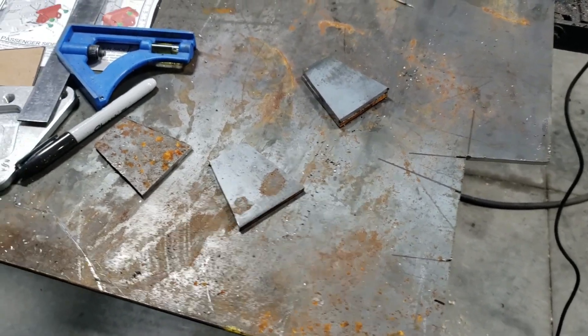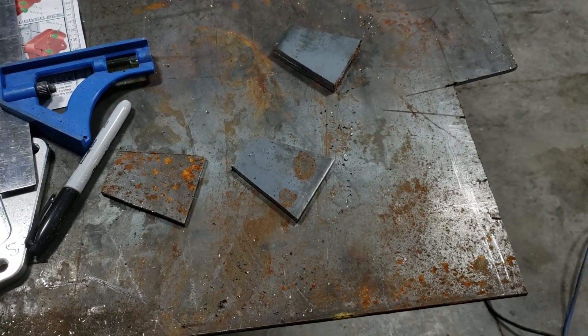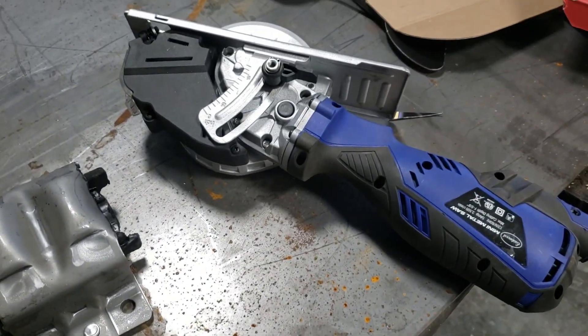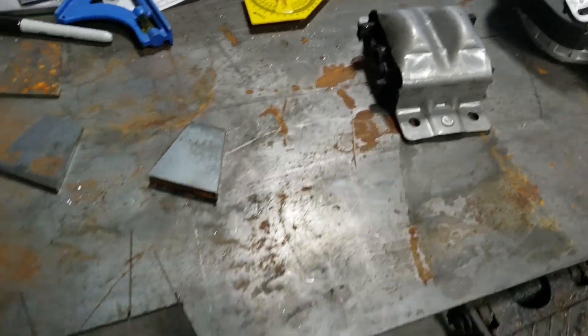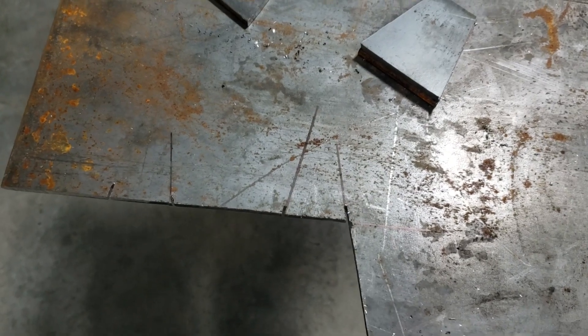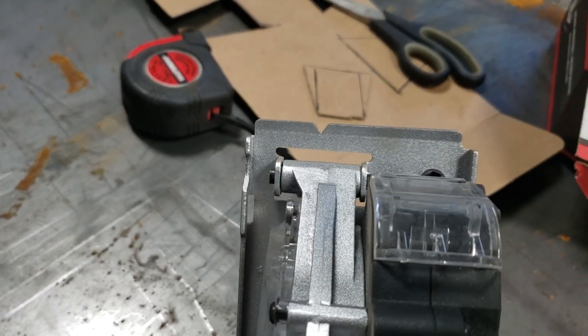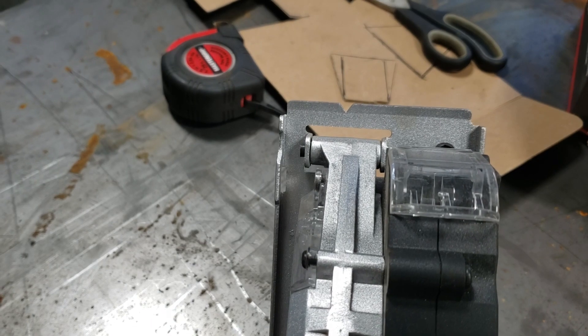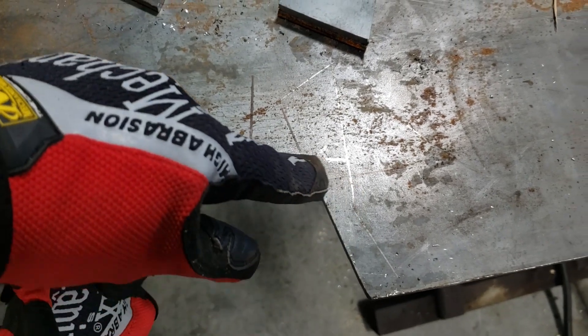I'll give you a little fabrication trick that I do — kind of fixes being a hack. I'm using this little metal skill saw. It works good up to a quarter inch — you've got to take your time, but it just leaves little filings and not dust. When you're marking something out for that saw, because it's got this little increment on the front — that little cutaway that's supposed to be your straight line — you can't see that where it stops, so you have to extend the lines longer than what your piece is so you can have a guide for cutting.